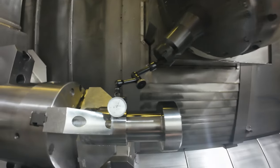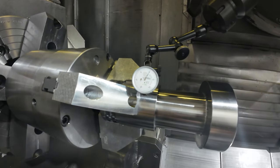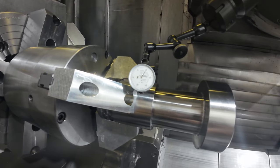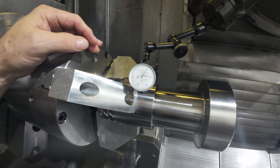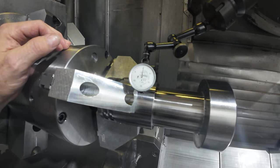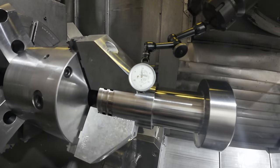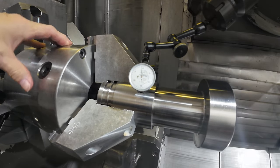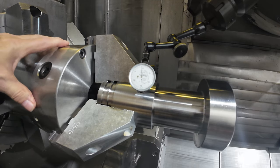Let me move the camera in a little closer so you can see what's happening here. I'm going to establish some kind of a zero point here by jogging the X-axis. Now I have the C-axis coupled so I'm going to jog the C-axis to rotate the chuck. There are holes — this is a set-true three-jaw chuck on this arbor thing that I made to go into the bigger four-jaw chuck back here.